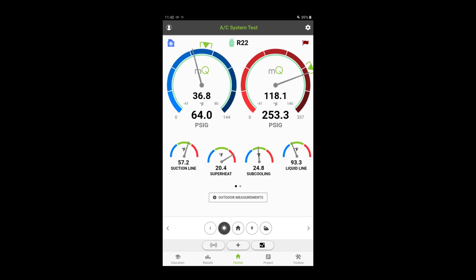We're going to add a little gas to this. We can get that superheat down a little bit — you've got to do it slowly because you don't want to overcharge it. We were calling for about five degrees superheat. Probably going to leave it about there — let's let it run for a while and see how it operates. At this point it's acting kind of interesting — see how my superheat's fluctuating like that. That's a little bit scary, almost like there's non-condensables in there, but I don't think there is. I put a compressor in this like a year and a half ago and I don't think anyone has worked on it since me.